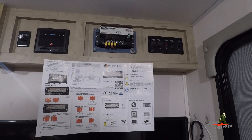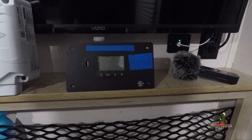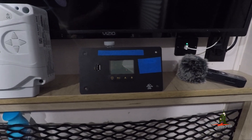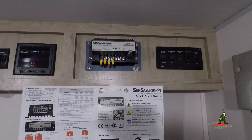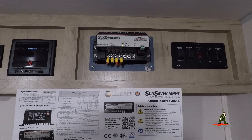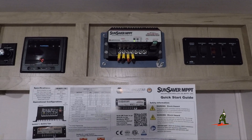What I can do now to increase the efficiency of the system is upgrade the charge controller, and that's what I've done. I removed the old PWM, or pulse width modulation, charge controller and installed a Morningstar MPPT charge controller, which will give me a 20 to 25% improvement in efficiency of charging the batteries. For those of you who follow my channel, I also use a Morningstar charge controller on my off-grid solar retreat project — I love their products because they work well, last forever, and have great technical support.